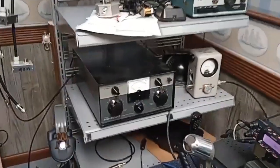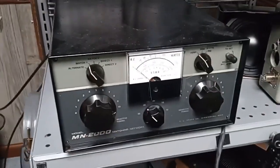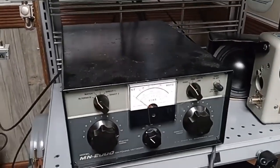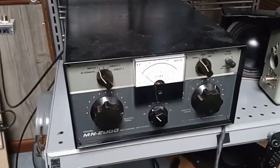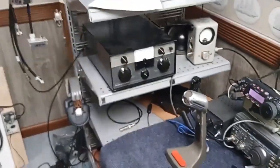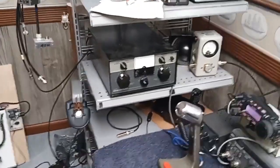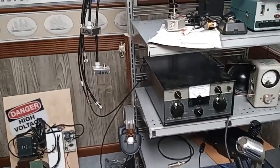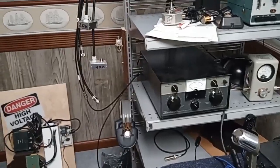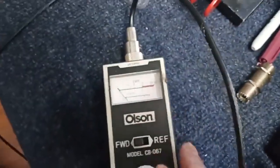She was in here while I was out at the meter, and she was watching the SWR meter on a Drake, and we'd arranged that I would just stand under the antenna and not do anything. She observed the meter, and what happened? Nothing. It didn't move. That's what happens when we put dielectric bodies in the fields of antennas. They're absorptive, and I absorbed energy. But after the second time I waved, what did it do? It's still pretty much nothing. And the third time, nothing.